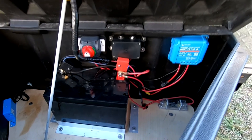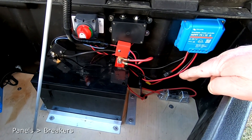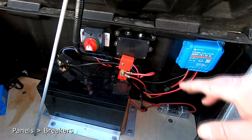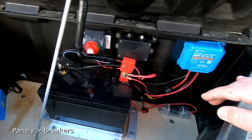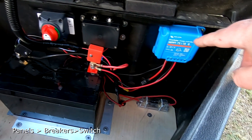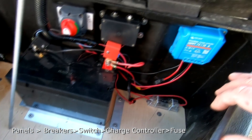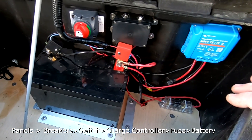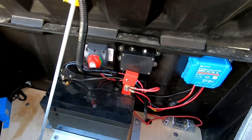I've got the electrical made up. I've got 10-gauge wires coming from the solar panel going into a breaker box with two 5-amp breakers — because this is going to be a 2.71-amp system coming into the charge controller. From there it goes to the switch, then to the charge controller. From the charge controller, the positive lead goes to a 15-amp fuse — because it's a 15-amp charge controller — and then to the battery. The last thing to do is tidy all these wires up, but let's plug the solar panels in and see how it works.